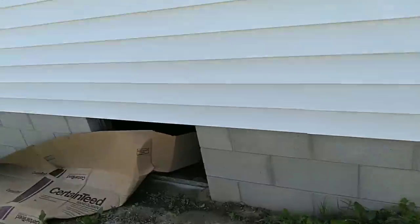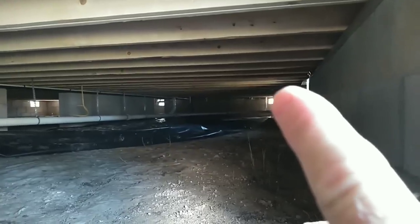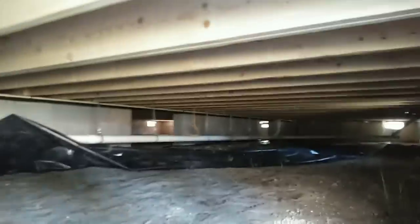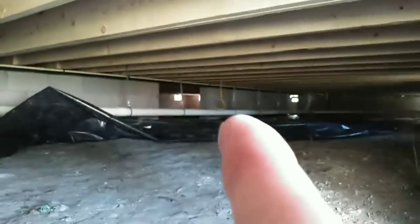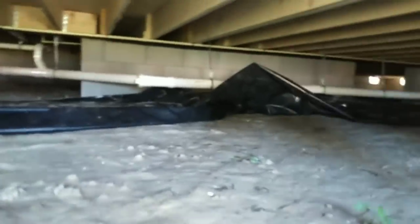This house does not have any heating and air equipment underneath it, so I don't have to supply it. There is a wire loop that comes down from the outside receptacles, and that wire you see hanging there is for the end of the peninsula. But there's no heating and air equipment under here, so no outlets or lights are required in this crawl space.